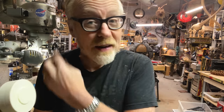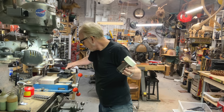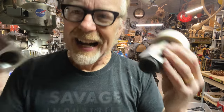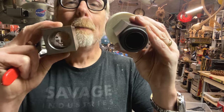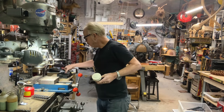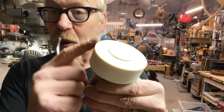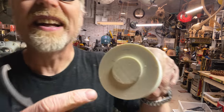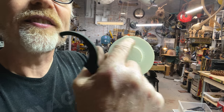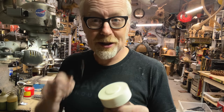Yeah, it's way faster if you need to do a hexagon, and they also make a square one. I have yet to find an octagonal one, but these 5C collet blocks are a fantastic addition to a milling setup because they allow for a quick thing like this to work quite nicely. So I'm going to chuck this in the mill, and I'm going to cut six surfaces at that line, and that should give me the magneto center frame that I'm looking for.